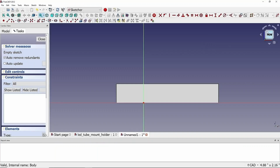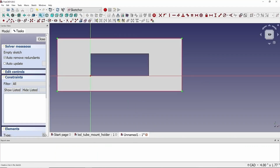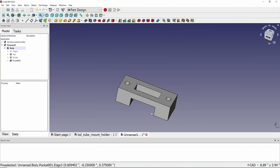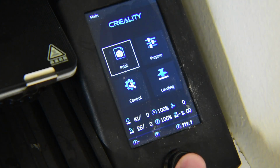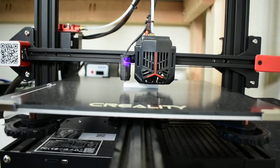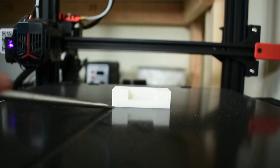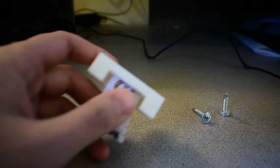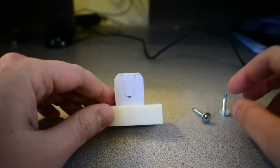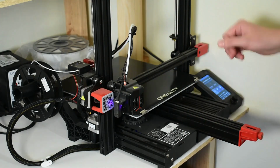I designed the part to surround the base of the clip, and I made sure to have enough room so that way the light could still get in and out of the clip. I added 2 holes for screws so that way I could easily attach it to the piece of wood in the next part of the build. After that, I 3D printed the first part and made sure that it would fit. Then I 3D printed the rest of the clips that I would need.